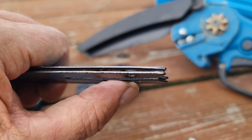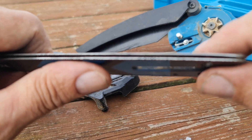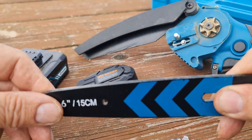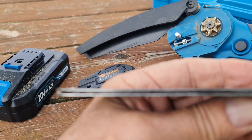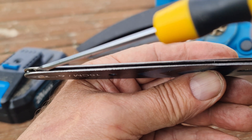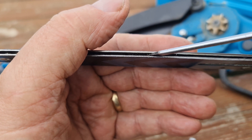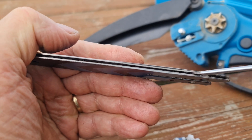I just spotted this today — she was cutting out and getting quite warm quite quick. So you flick it over. This is the bottom part of the blade which goes through the wood you're cutting. If you look, that's turning nicely, then you bring your screwdriver down here and it starts to jam. My screwdriver is now jamming — I'm struggling to get that through.